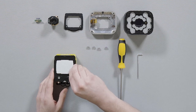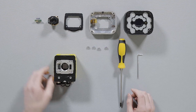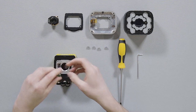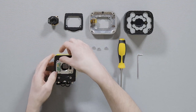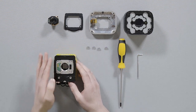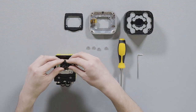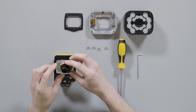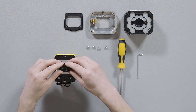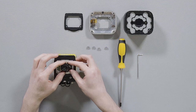The first step again is to remove the protective plastic film from the C-mount flange of the device. Then put in the illumination PCB that comes with the multi-torch kit, making sure the pins are facing upwards in the top left. Once that's installed, install the high-speed liquid lens by lining up two screws with the two holes and the five-pin connector with the one on the right-hand side.